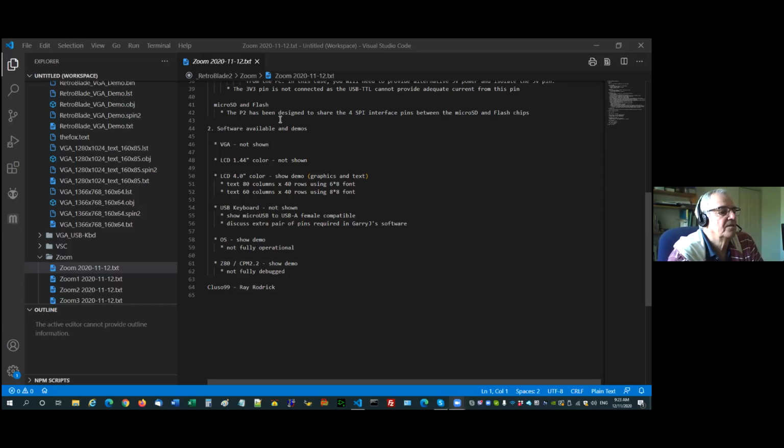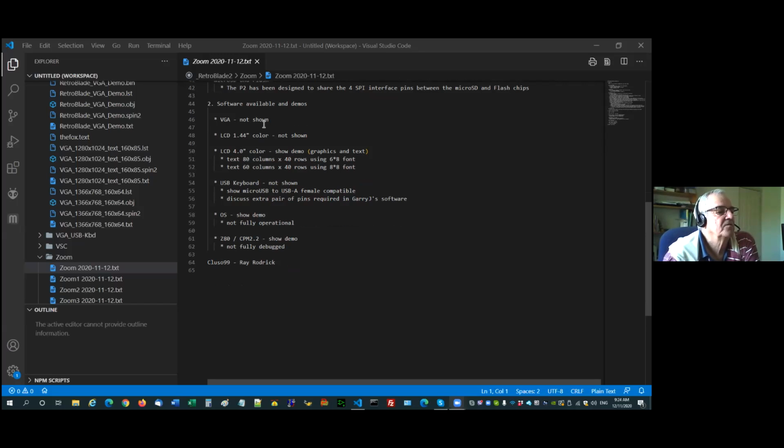Right, there is a different bug in Peanut, which I'll come on to later, because Peanut doesn't like having a flash chip, having a micro SD port chip in there. Its timing's incorrect for the reset. I'll talk with Chip offline about that too, because it should be an easy fix.